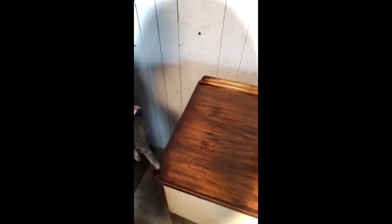This here, if you can see, is still a lot of stain, right? That means my paint stripper wasn't thick enough here to take off the rest of this. So I need to go back and redo this area and let it sit. It's coming off here, not bad, but you can see spots where there's still paint stripper. So don't ever leave it like that. Just take another tablespoon or two of your paint stripper and put it right back on.